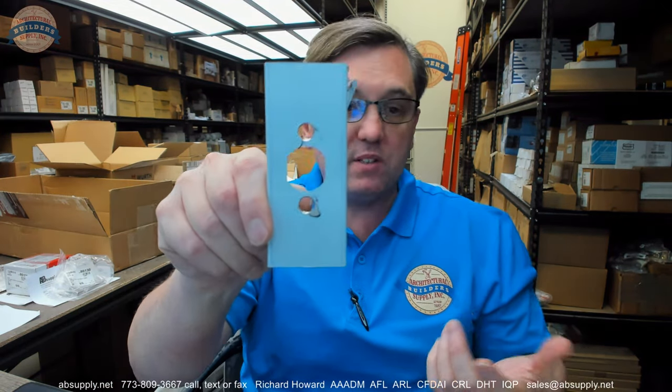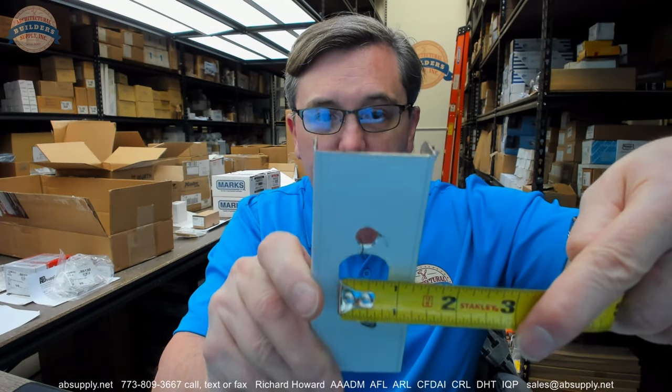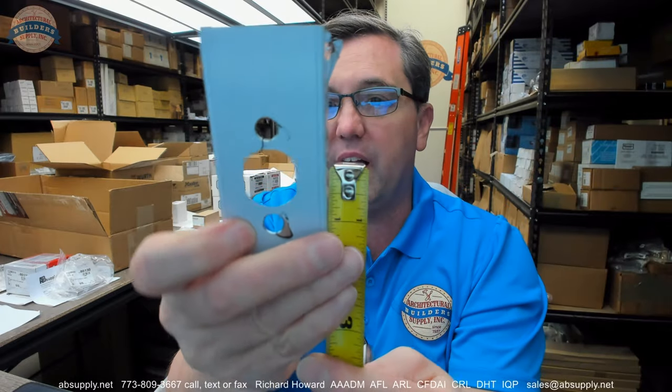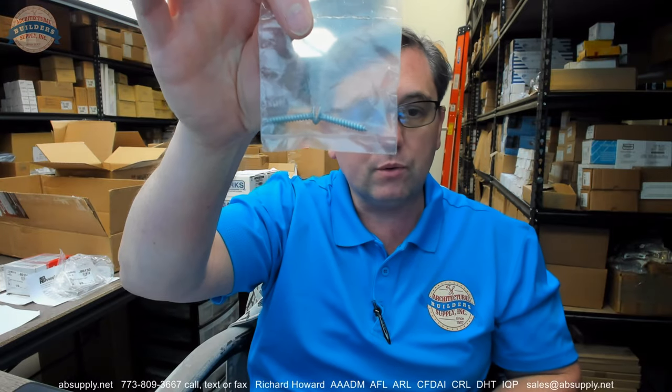And what I was driving at earlier about it looking like a deadbolt is that's the profile or the cutout shape of a deadbolt. The width is going to be about 13/16. The height of the bolt itself is going to be about 1 inch. It's going to have a typical 1 inch projection. All deadbolts, not all, but most deadbolts do. You'll have those undercut screws to install that.